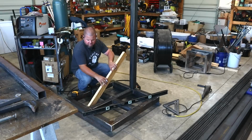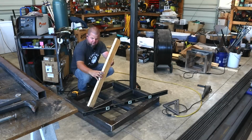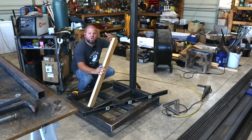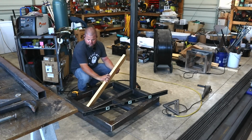Now I'm going to put a brace in. I can't just put a 45 brace and run on down like this, which would give me a little extra strength, but we're working with thick steel here because the brace itself would be too low. When this is all flipped over, you could potentially hit that with your head and it would not follow code.